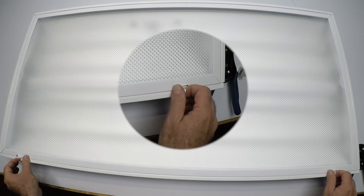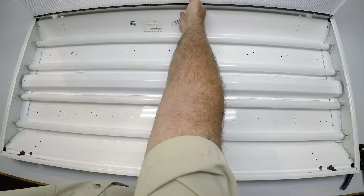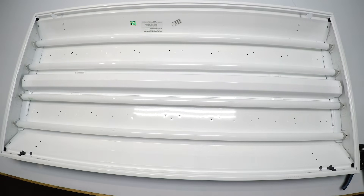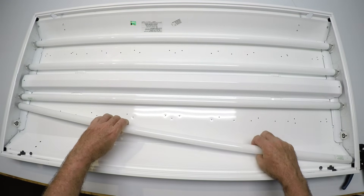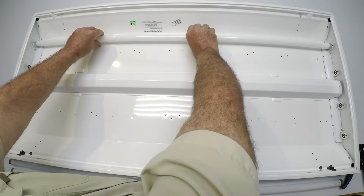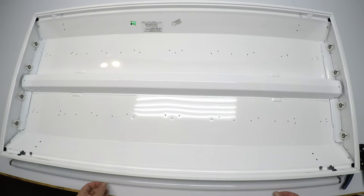All light fixtures that have lenses have some way of opening them — you always have to be able to access the light bulbs from below without taking the light fixture apart. If you pull the little tabs, just pull these little tabs, you can take this lens and swing it open, and you can either let it hang or remove it entirely. They just pop right out, and you can take it away and expose the inside of your light fixture. This is a four-light fixture, already lamped up with some T8 fluorescent bulbs, and we're going to remove these right now. Sometimes you have to turn them sideways and jockey them around just a little bit to take the lamp out. Donate them to somebody that has fluorescent fixtures — they'll be real happy about that. Or show them our video and have them move up to an LED.